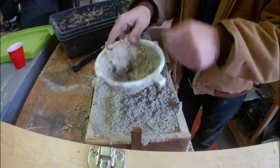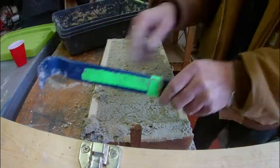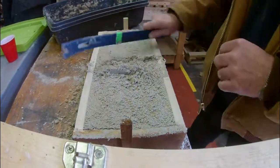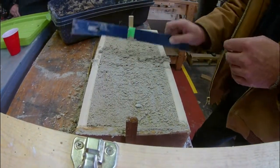These little wooden molds have been constructed out of 1/8 inch plywood and glued together. After we get a clean enough impression of the snowflake in the sand, then we'll just pour some molten aluminum into it, and afterwards, when it's frozen, we'll just cut out the snowflake.